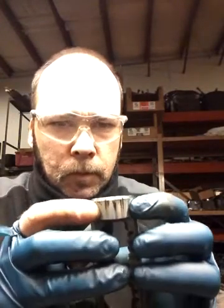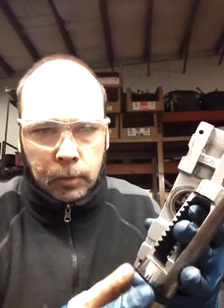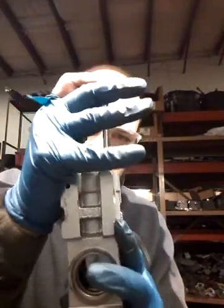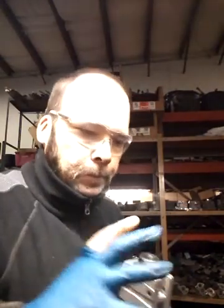Insert it in there. And if you see these double cuts right here, these are relief cuts milled onto the piston, and of course you can see your rack. Alright, the two side by side milled cuts will go down, and that rack will go to the flat surface of the door closer. It's real easy, nothing really gets forced, it just fits in there real easy.